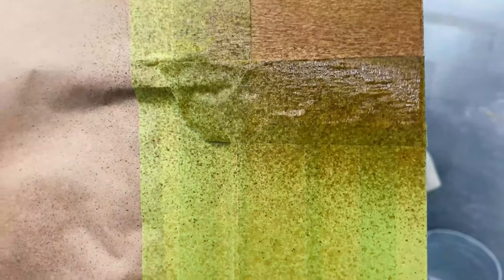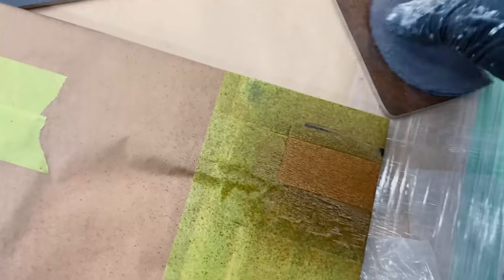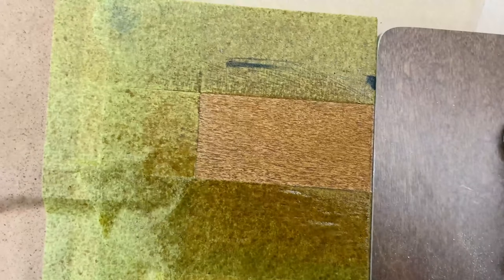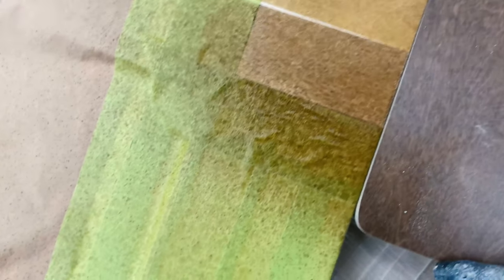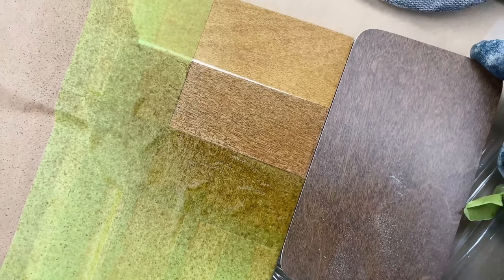Second pass. You can see it's not that much of an error — this does look a little granular. So this is two passes, and not enough color is actually good because you can always add more and make your stain more intense rather than getting it too far. It's getting there — the first sample was a lot yellower and this one is a lot closer, so we're moving in the right direction. It's still a little greenish, but it's wet. As it dries it's going to change color slightly, and when we add the clear coat it's going to pop and make it a little deeper.